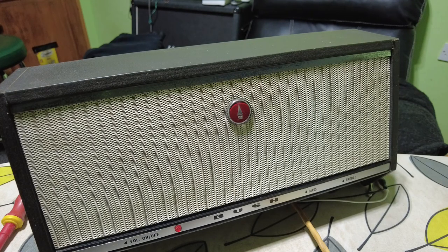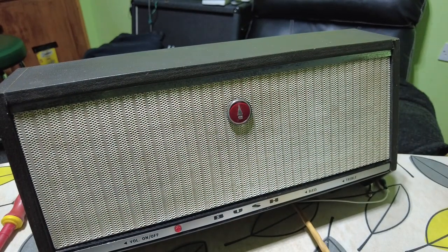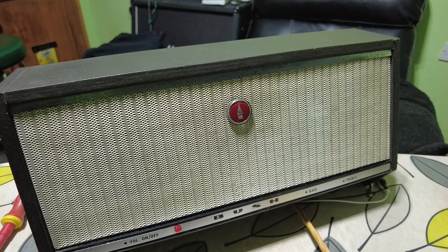We're probably lacking a bit of HT voltage as well — we could modify the power supply to get a bit more HT. And obviously changing that speaker to something better will give us a bit more volume. It'd actually be nice if we could get a couple of speakers in there, but there is room on the panel. On the side where that tweeter is, that's where the output tubes are and I think they will be obstructing another speaker, so I don't think we'll get one in — not at a glance. Even if it does fit, it'll be tight.